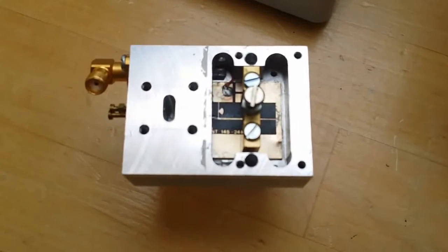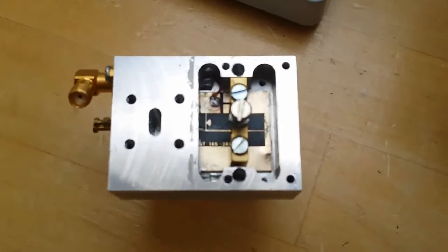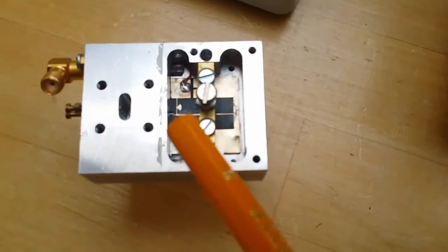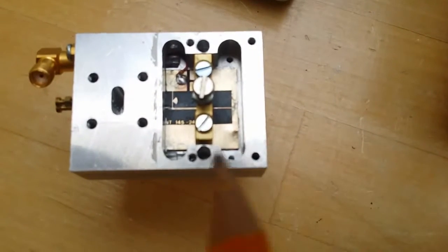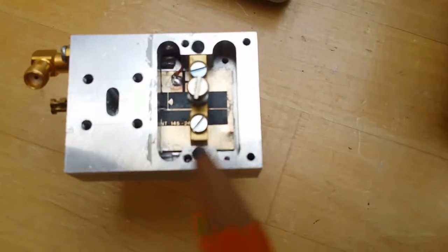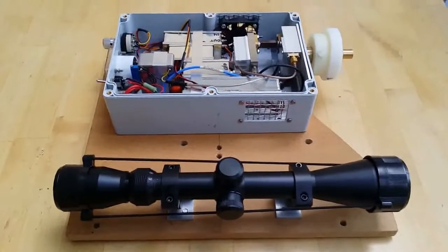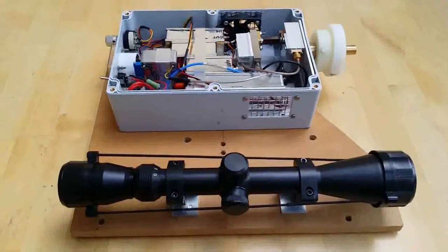The multiplier diode is similar to this one, where the input waveguide feeds a DB6NT PCB which has had the normal coaxial input cut off, so that the probe enters in line with the track from the waveguide, and then back over the top of the multiplier diode.